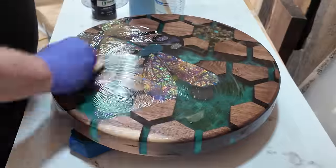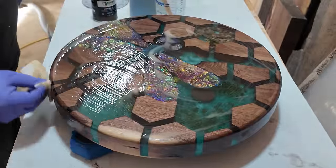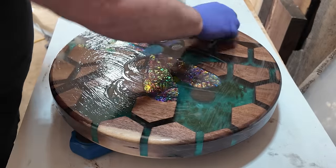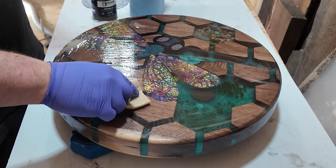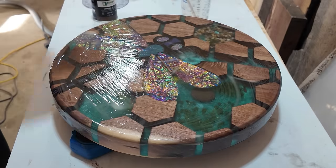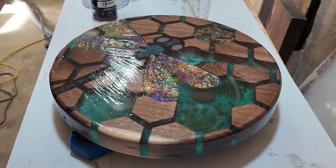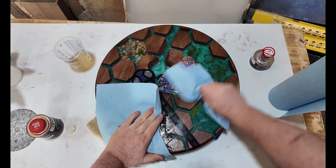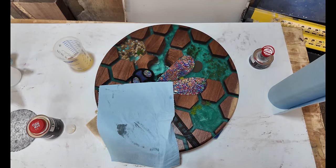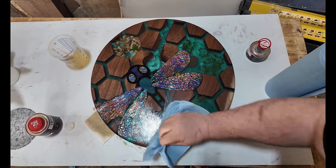So you may notice I am using a different hard wax. I'm using Natura, which actually tested a little bit better than the Rubio Monocoat in my independent testing. I don't believe anybody else's testing because I think they typically have a monetary agenda. I can tell you for sure I'm not sponsored by Natura. They sent me this one little bottle of it, but I had already bought a big bottle of it, so it didn't help all that much. But when I tested it, it was slightly more resistant to acids than Rubio was. It was slightly more durable than Rubio was.